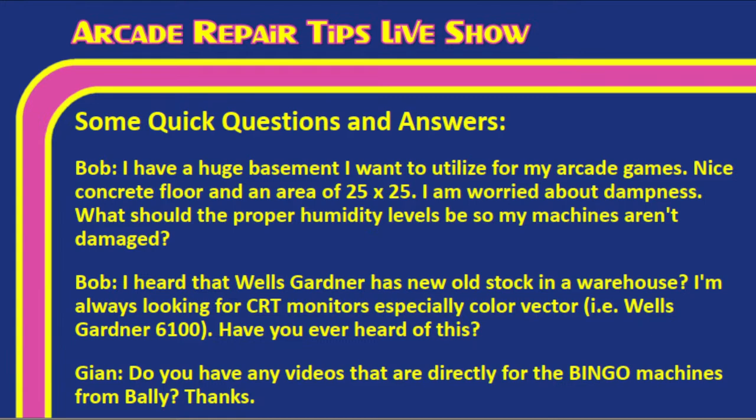And so, Tim, with those in mind, let's go ahead and take them one at a time. So let's talk about humidity real quick, Tim. I'm in a basement, 25 by 25. What kind of humidity levels do I really want to have in there in order to run games? Well, there's one thing we know about here in Texas and Louisiana and anywhere in the South, and that is humidity. Absolutely. We deal with it on a constant basis. Right now we're running about 70 to 80% humidity, which makes it really hot. But I know what he's talking about on concrete floor. As long as you don't see sweating or condensation forming, probably not something you've got to really worry about. You want to be at about 60% or less.